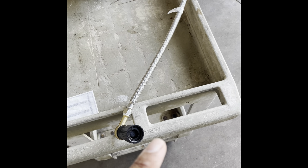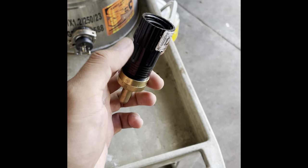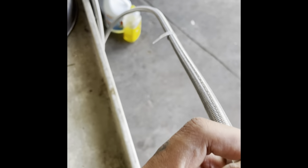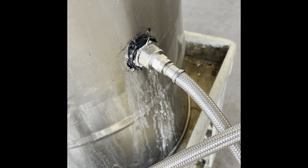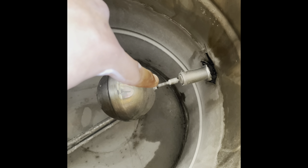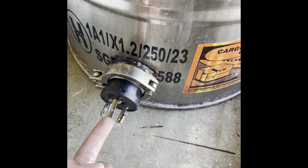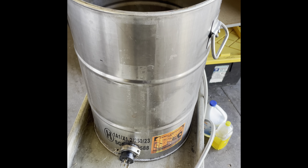To summarize quickly: from the spigot you add a 25 PSI pressure regulator to your universal water line adapter, thread it onto your barrel with your float valve, with RTV silicone beads on both sides to keep it watertight. You may need to replace the float valve stem like I did. Then weldless bulkhead, heating element, and tri-clamp to hold it in place — those are the basic mechanics of it.